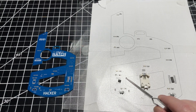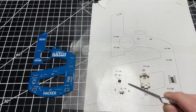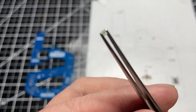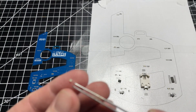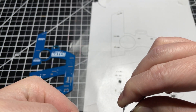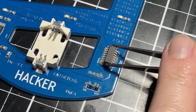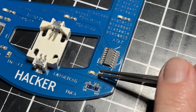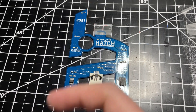Now it's time to place the components onto the PCB. Sometimes it's difficult to determine polarity on components. For LEDs, there is usually a green mark on the top or bottom. On the bottom, the mark looks like a T, and the bottom of the T points towards the ground pole of the LED. Sometimes the LED also has a green mark on the top side which denotes the ground side. The integrated circuits are lined up using the small dot on top of the chip. These resistors do not have a polarity. Now all of the components are placed.